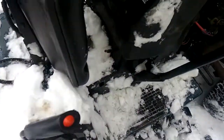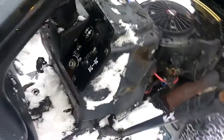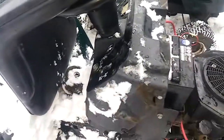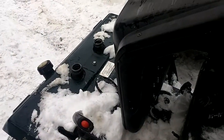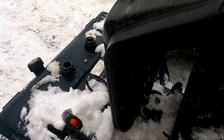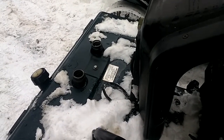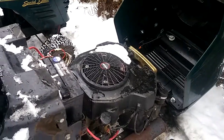The deck's missing the chute cover — not a big deal — but other than that it's there. I don't know its condition yet. I have another 44-inch deck sitting back there; I'll sell them both in the spring. As for the hydro — it's a side-drive hydro. When you go to put it in gear, it's just spinning. So most likely one of the input shafts in the actual transmission is busted. But I can pillage this thing for everything and use it on the diesel.